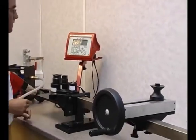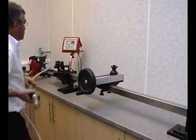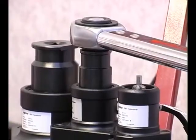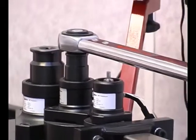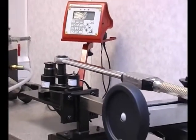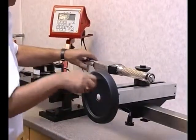The TWL-1500 is an accurate and cost-effective loading rig for calibrating torque wrenches between 1 and 1500 Newton meters. Large torque wrenches can be operated effortlessly by simply winding the handle, while the TTT captures the first peak of torque in the case of click-type torque wrenches.